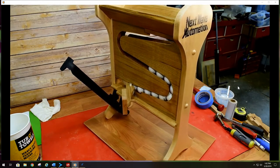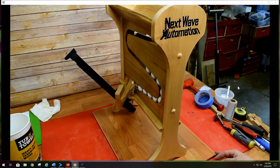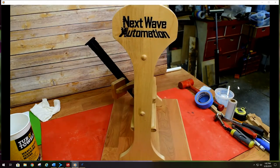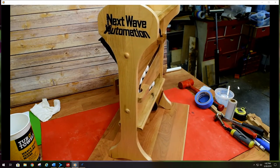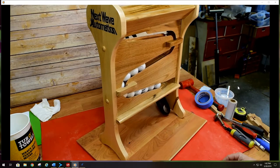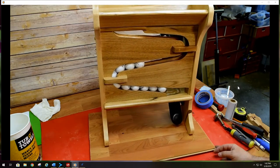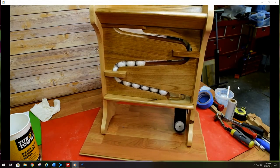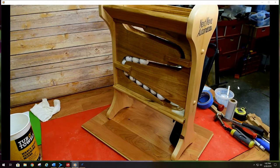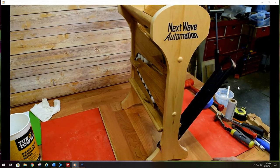Once you have made the necessary recalculations for your machine and tools, reset the preview, then preview all tool paths again to visually verify the project's outcomes. Create the tool tap files for your machine by using the correct post processor. I cannot emphasize enough, make sure you use the post processor for your machine.